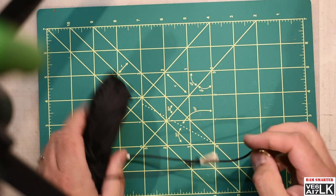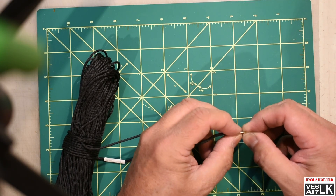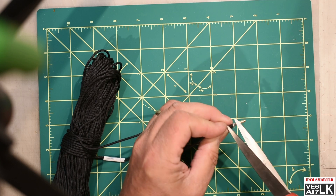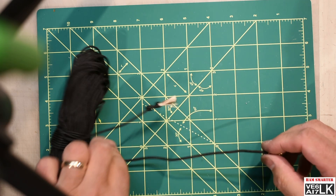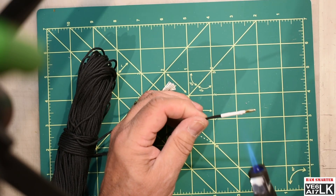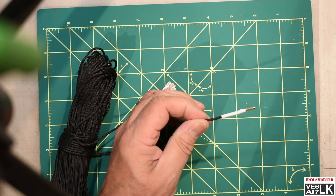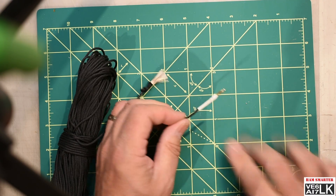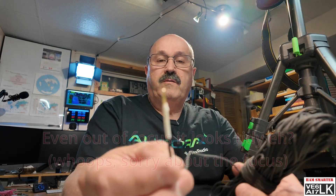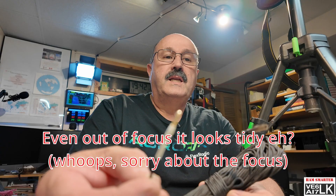Let me pull that back and get my soldering helper — my third-hand holder — out of the way. That doesn't look too bad. I'm going to cover it up with some heat shrink. I'll trim away the extra little hairs there before I do, and get a piece of heat shrink over top of that. I'm not using anything special — this is 1/8 inch heat shrink. I use an open flame to do my heat shrinking; I do have a gun but it's noisy for video purposes. So I'm just going to delicately hit that with the tip of the heat, just enough to shrink it down. And there we go — that's neatly conformed to that connector. It's still a little bit warm, as you would expect, so once it cools down I'll be able to handle it.